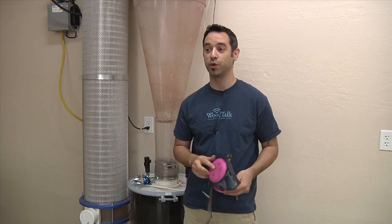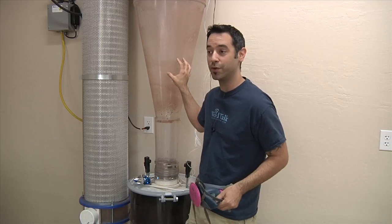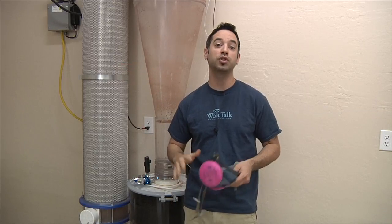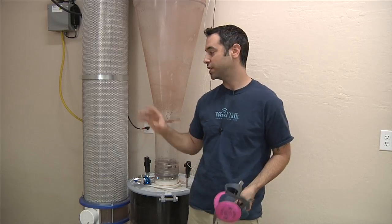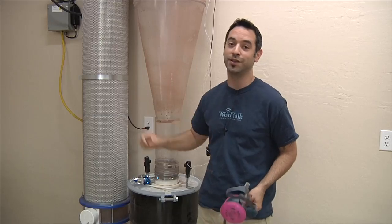If you can have one of those roll-around dust collectors, connect it to each tool, and make sure that dust never hits the air in the first place, that's the way to go. If you have enough space and budget, you can get something like this — a cyclone, or any other type of large dust collection unit — and then pipe ductwork throughout your shop to collect at each individual tool, which is the most convenient, but certainly stretches the budget a bit more. So let's get into the details of the installation and assembly of a Clearview CV1800.